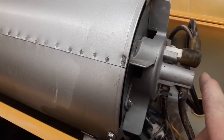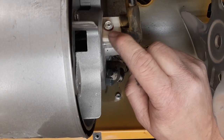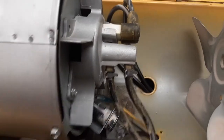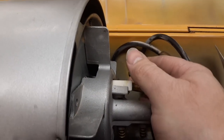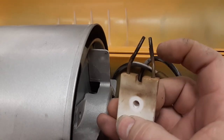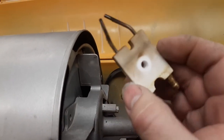So I'm going to remove the hoses here, pull them off, then take a screwdriver and remove the igniter assembly. Be careful with this piece right here because it is ceramic — you don't want to break it or you'll have to replace it. I got the wires removed, the hoses removed, and I went ahead and pulled the screw out and carefully pulled it out. There's an arc that jumps between the two electrodes as the fuel blows through — that's what ignites your fire.